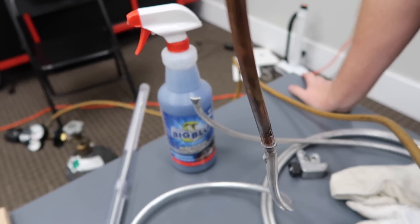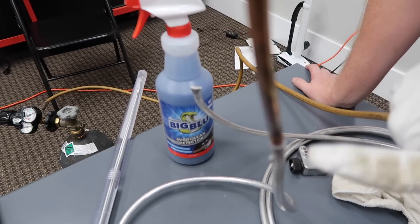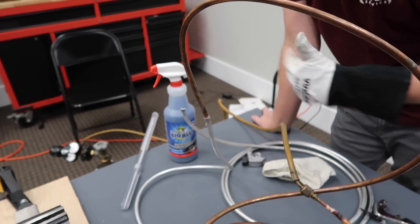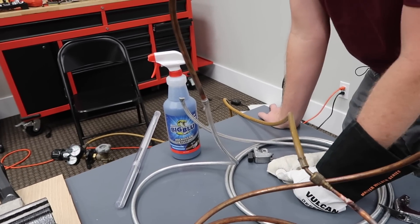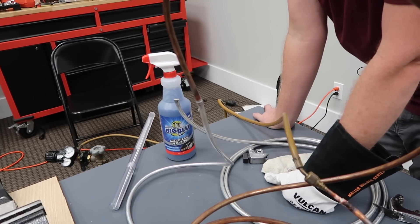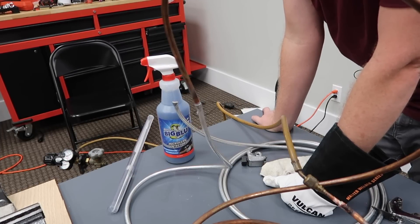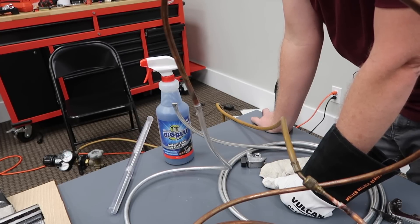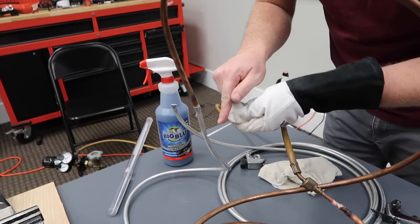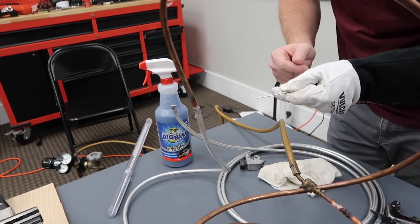So while the ring method can work when it's tight, you have to make sure to get a nice tight ring, and it's best used in this orientation with the aluminum swedge. You can do it the other way, but it's advantageous to swedge the aluminum and fit the copper inside of the aluminum, because the copper has higher heat conductance, so it's going to tend to draw the solder more into the joint. The product works great — you've got to make sure to keep your metals clean and get a nice tight fit. Those are the two biggest factors. If you try it the first time and it doesn't work, just try it again — you'll get the hang of it. You just need to work with it with the flux side down towards the pipe, so the flux, which is the white powder inside of the channel, must be working down towards the tubing you're working with.